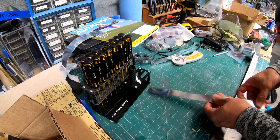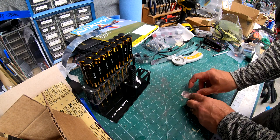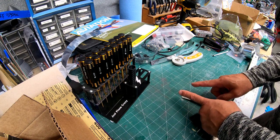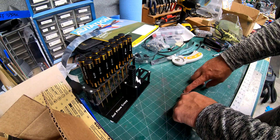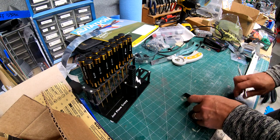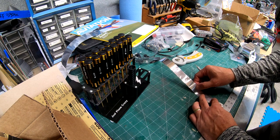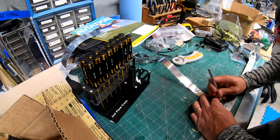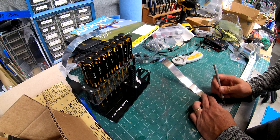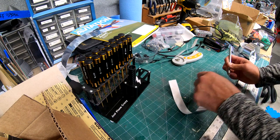And now we're 1 inch at one end and 3/4 at the other end, but you can't just measure 3/4 and cut it, because then you'll have one straight and one tapered. We want them both to come in. So that means we have to take a quarter inch off of each side. So basically we're going to subtract 1/8 of an inch off of each end. So from here, I'm going to mark 1/8, and from this side I mark 1/8.